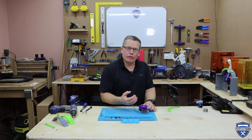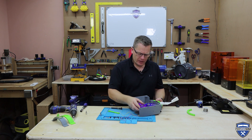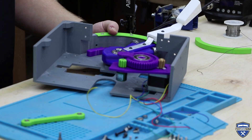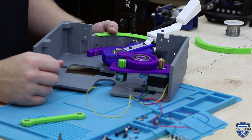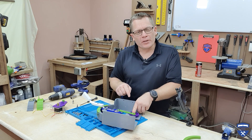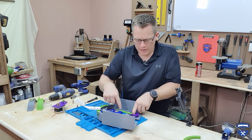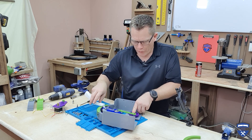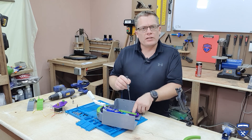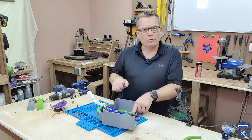It's fantastic to see that the gear meshing appears to work perfectly. It feels good — it has that friction that's held by the stepper motor. This gear meshing and stepper mechanism is designed to fit in this bottom corner here. I've basically just sliced this design and printed those three square inches. You can see that I've used this as a very crude holding device. That's where the shaft of the new left-hand side will come through and you can see its basic operation. This link here is not interfering with the brake stem, which is what I was worried about — it's very clear. And I'm cautious of this cutout here, which is the through drive for the trim wheels, so I don't want to get too close to this otherwise we'll have interference problems.